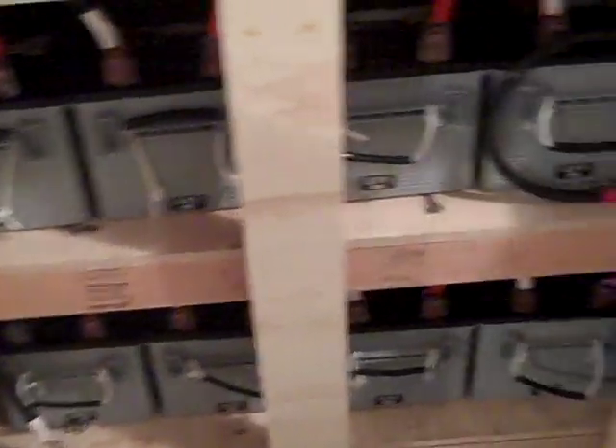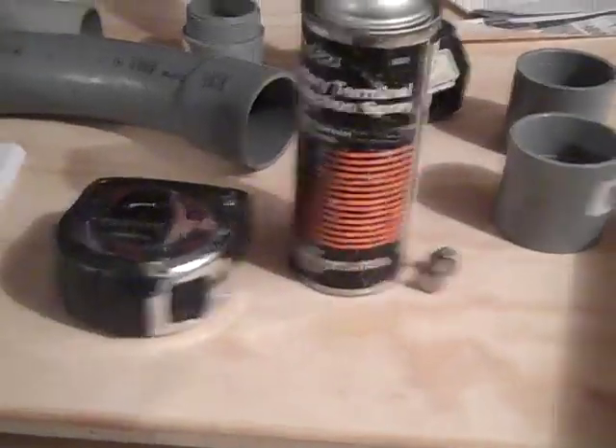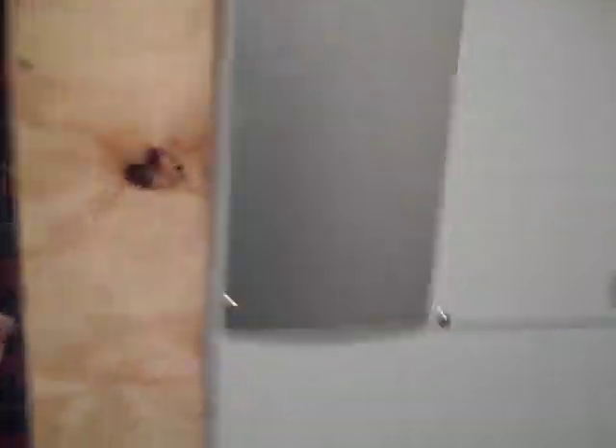We've identified kitchen circuits, refrigerator, washing machine, and the well pump. We're going to put a secure panel right up here on the wall and pull those critical circuits out of the existing panel to run as secure circuits. The battery cabinet is here — Sun Store Solar makes their own battery cabinets. The batteries are hooked together but not yet connected to the system — two parallel strings, 48-volt system.